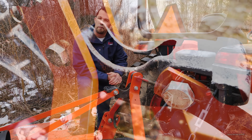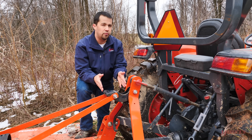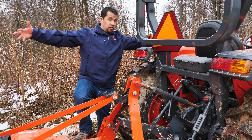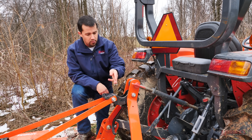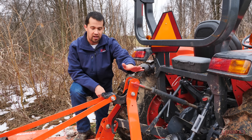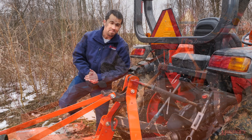This cast piece right here is called a floating top link. What it allows is — if you're driving along and the back end of the mower is pushed up, or your tractor goes down into a swale — it allows this part of the mower to flex so that your whole rig, basically 30 feet long front to back, can go through undulations in the ground. On some less expensive mowers, this piece isn't always present — you'll get these arms pinned directly up to the top link of the three-point. Having that flex link in there makes the mower and tractor contour the ground a lot better.